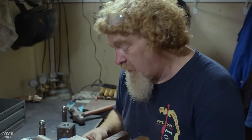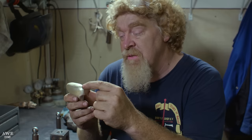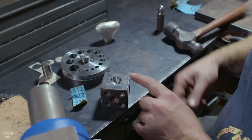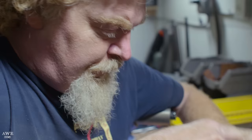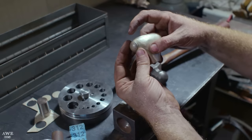The ends of this pommel have exact domes made for them. I'm going to make them out of these silver discs using a dapping block — I'll come in with something slightly smaller to leave a gap for the thickness of the silver, creating a nice even rounded end. We'll cut this off, and then these get soldered in place with a border that goes around the outside.